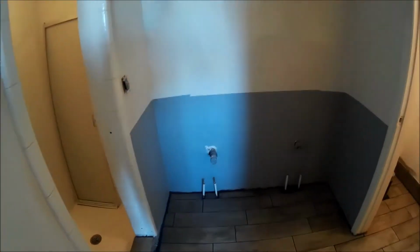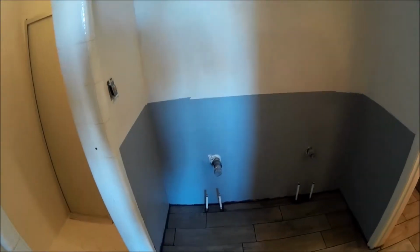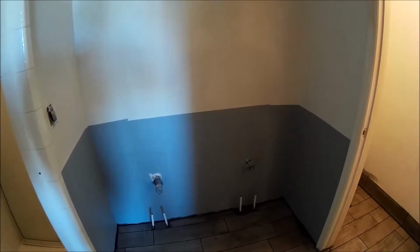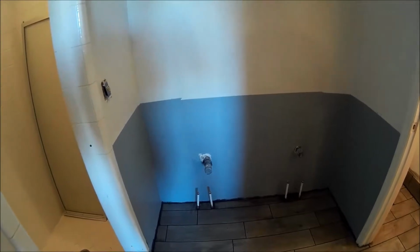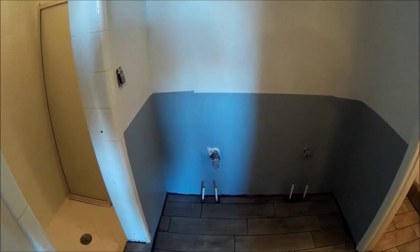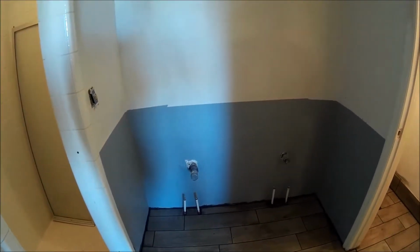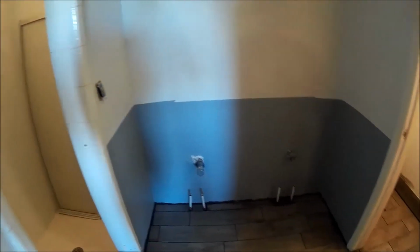But that's one reason. The other reason being, go price vanities. Look at how ridiculous the cost of bathroom vanities is. And then to get the style and shape and size and everything I want, I kind of have to almost make it myself. But I'm not going to fully make it myself. I'm going to take off-the-shelf stock cabinetry from Home Depot and make it fit where I want it to go, which is two 30-inch wide bases, but cut them down to about 21 and maybe 20 and a half, and then put a stone slab countertop with undermount sinks on top.